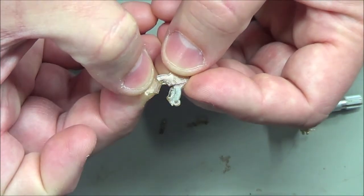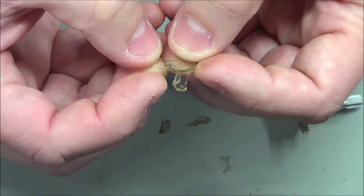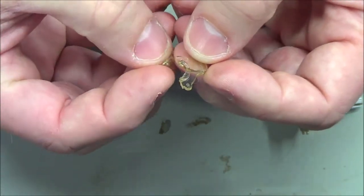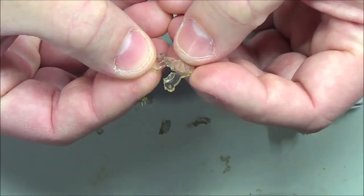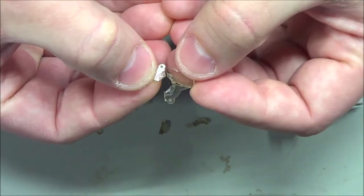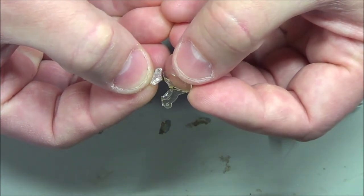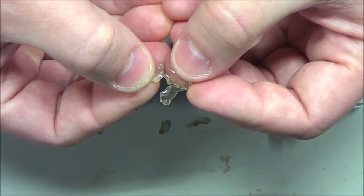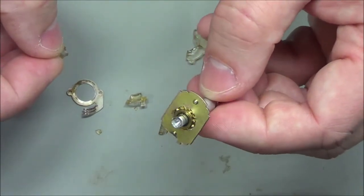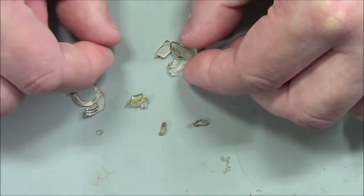See, we're starting to form a circular shape, and the one thing that doesn't look right here is those pins. That pin looks too far away. They should be opposing each other. I'm betting it goes like this instead. I think that's a little closer matched. That will put pins opposite each other from the center of the hole in the middle. And you can see the hole is starting to form a more rounded rectangular shape, which will match the rounded rectangular shape at the end of the shaft and the two flat edges. So that would go there.